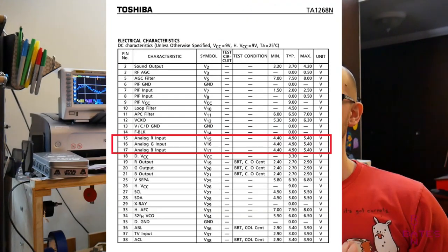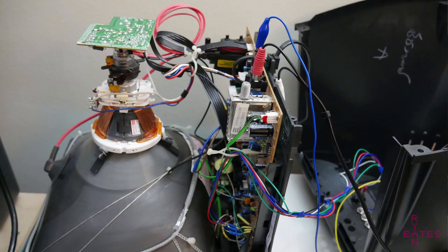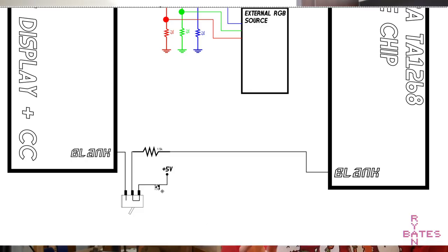Looking at those data sheets more closely tells you what incoming voltage levels are recommended for the jungle chip. I looked at the blanking signal, and it said I didn't want anything more than one volt to enable blanking. When I measured it, I was actually around 1.7 volts, so I ended up going back inside and adding a diode to ensure I'm not overdriving the blanking circuit — so I can ensure the longevity of this television. This TV is already 17 years old, and I wanted to avoid breaking it after this took me an entire Saturday to put together.